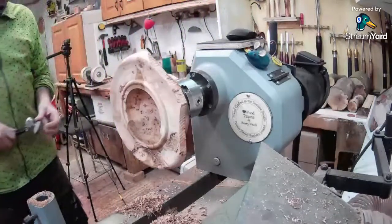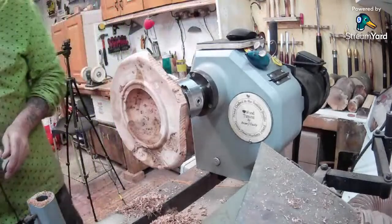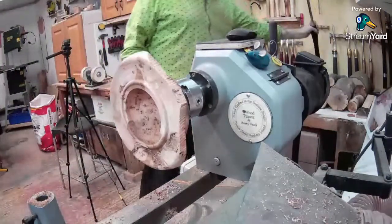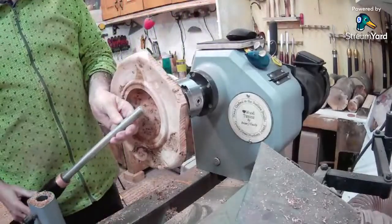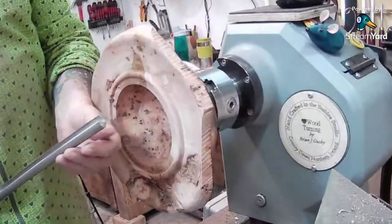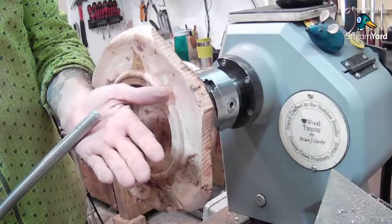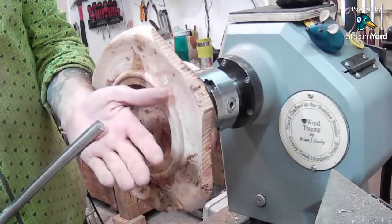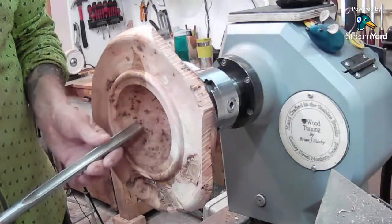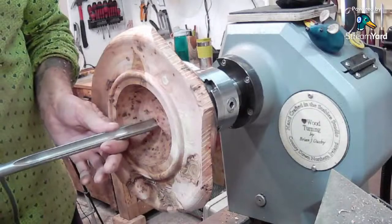Good work, Leonard. The bottom feeder grind is a traditional grind, or an English grind, or a straight over grind. Usually 60 degrees or more. Let me go to close up zoom now. That's a 60 degree grind on there, and it makes life nice and easy because you can rub the bevel and you can actually push it straight across. Instead of having to come up and come back down, change wings, you can just go straight across.